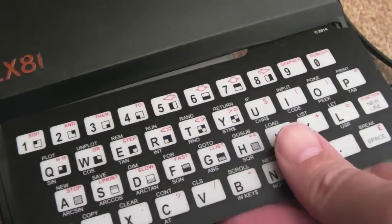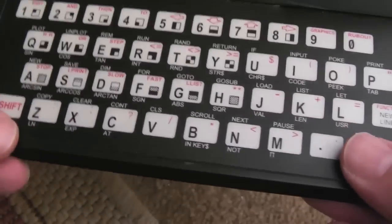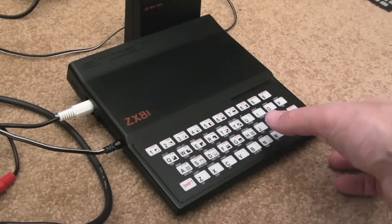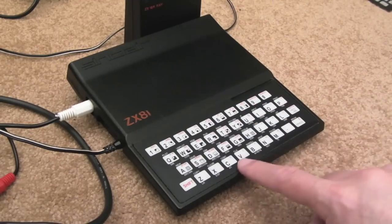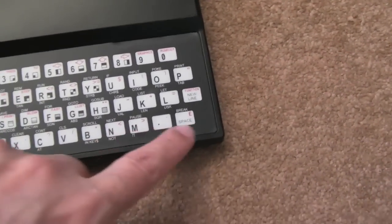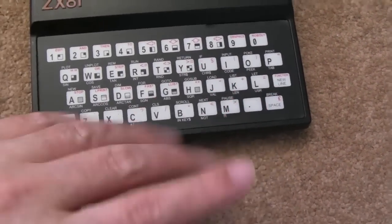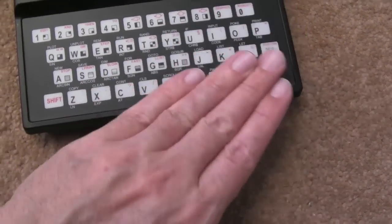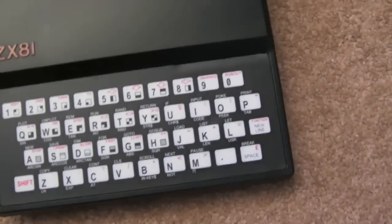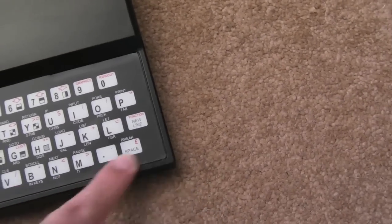All reassembled - second time. I got this area totally flat. The way I did it was to use a hot air dryer, heated it up, and then just put pressure in that direction. Eventually after about 10 minutes of doing that, you can see it's pretty much sitting level in there. There's just a little bit of a ripple at the very bottom, but that's pretty much perfect. I'll just show you this on the main TV here just so you can see how much better the picture actually is over that small LCD I was using.